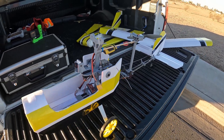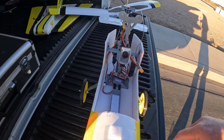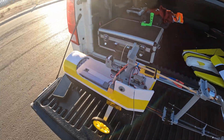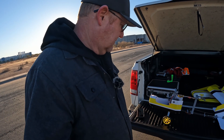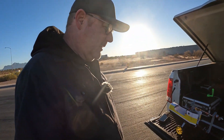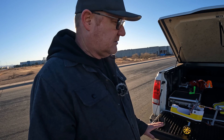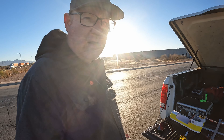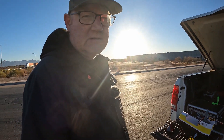I'm not running GPS on this one, and I'm waiting in the mail for my long-range receiver — the Team Blacksheep Crossfire 900 MHz. I have to remember not to fly too far with this current receiver. A warning for anyone beginning FPV: it's super easy to outfly the range of most standard 2.4 GHz receivers, so I recommend an ELRS or TBS Crossfire.